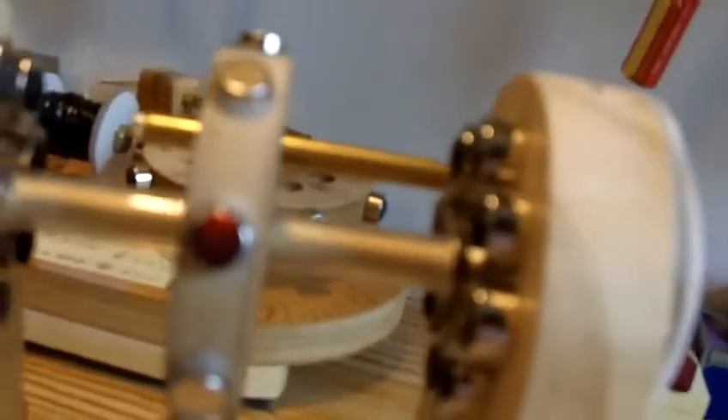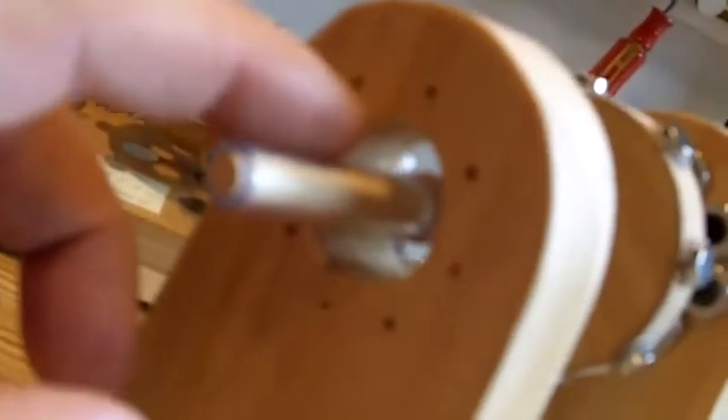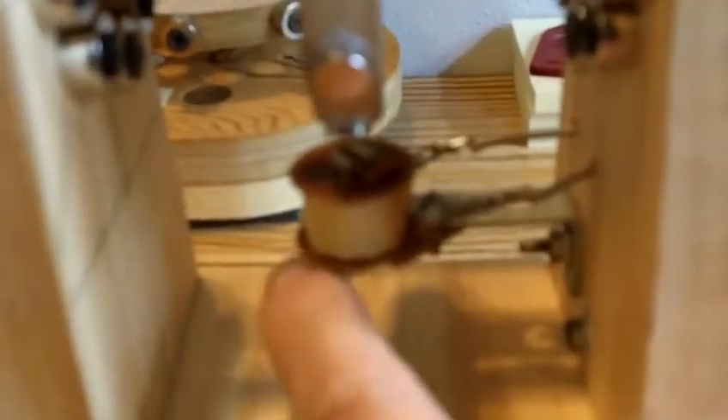The whole trick to the thing is getting them located exactly right in relation to the eight outer ring magnets — that's what causes it to thrust one way or the other. If you get them just right, which I finally managed to do, it will thrust just barely against this plate here, and the whole thing stays fairly stable. I cut plastic tubing that fits over the shaft snugly — one here, one on each side of the magnet — to ensure everything stays in place properly. The coil is nothing but a small wire round magnet out of an old relay. It works quite well.